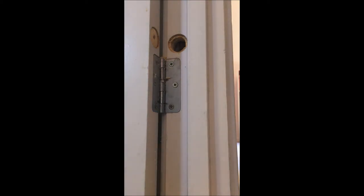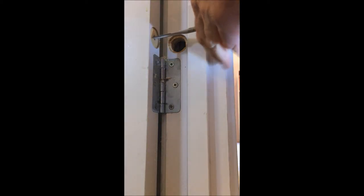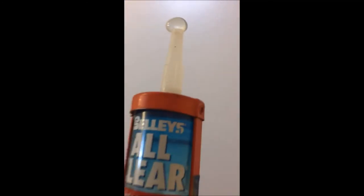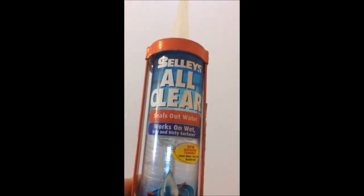Now what I do here is swap the 32 back to a 22mm spade bit. The spade bit has a slight circumference, making it create a little bit of a round. I'm just taking off any burrs or bits that will stop the push plate from sitting in flat. You can see the slight camber on the spade bit — it does create a little bit of a round.